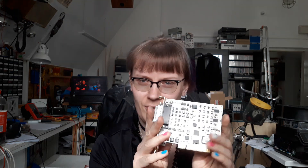The analog inputs could work with microphone levels for the first and second channel, and line levels for the 6 channels numbered 3 through 8. The analog outputs were typical line level unbalanced, with an exception of channels 7 and 8 where headphones could be connected. I got this little thing of beauty from my friend who works for an IT company.